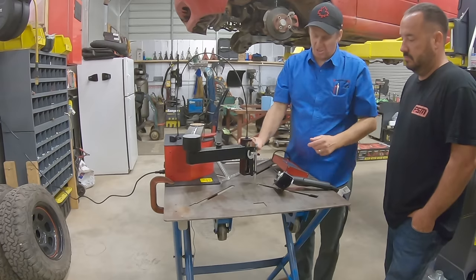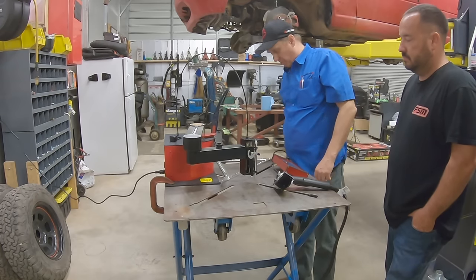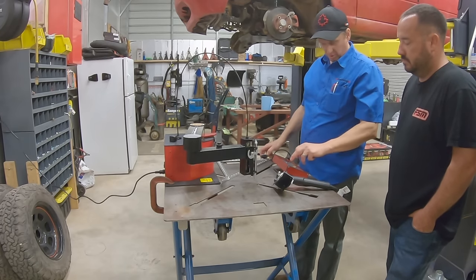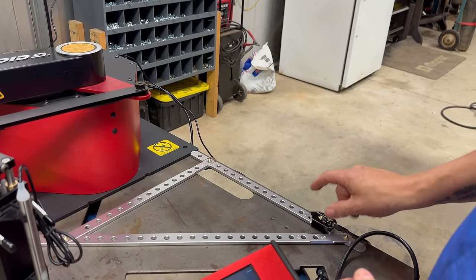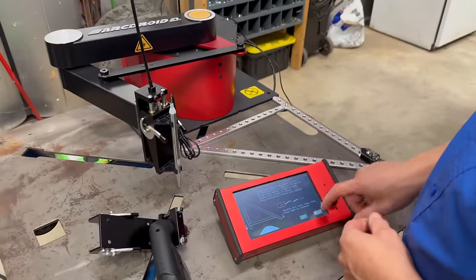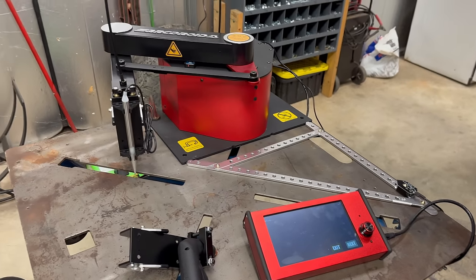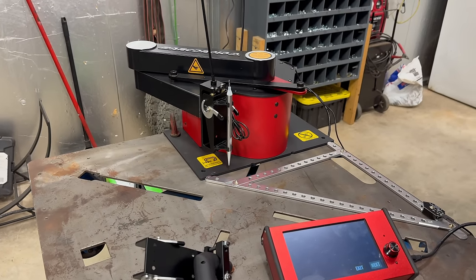We have a stylus which is at a known distance because we make it. You do a first run with the stylus and then a second run with the plasma cutter — it's actually pretty simple. There's a little sled you use to run along the calibration triangle. The first thing it does is home itself, setting its baseline by going back to the main stops.